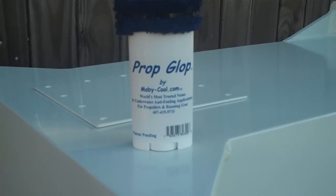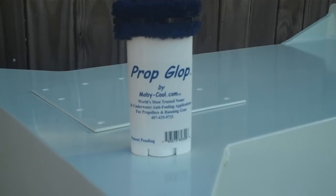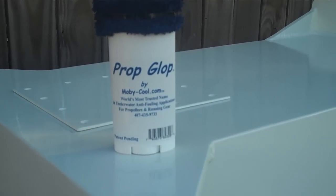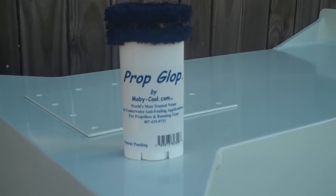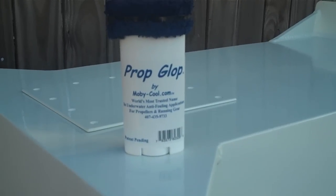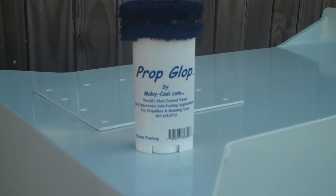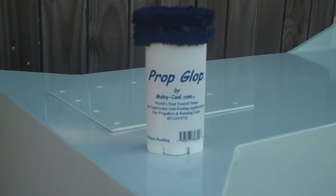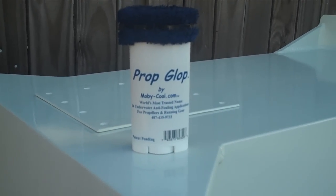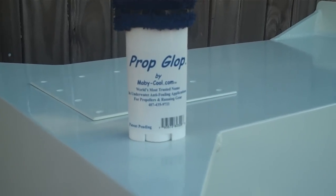It lasts between 90 and 100 days. Particularly great when you have your boat parked for a long time, but it's also pretty good for ordinary use vessels. It is a leach style product made to leach in your prop, rudders and shafts. The carrying agent doesn't have to stay there. Once it's been there for a few days, the active ingredients have soaked into the metals, paints, and primers, and that's how it works.